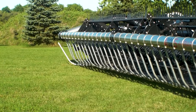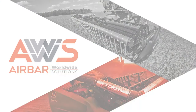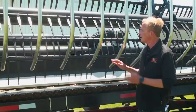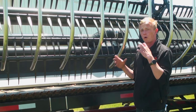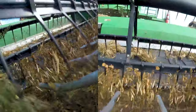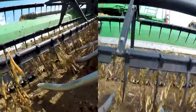AWS AirBar utilizes a single nozzle length design across the length of the head — either the 42-inch single bend nozzle or the longer 48-inch double bend nozzle. This ensures the greatest effectiveness and that there are no dead spots of air across the length of the knife. The incline of the canvas and more forward reel position of a draper head require a unique solution; the 48-inch double bend nozzles wrap the reel more efficiently, effectively moving crop up and away from the knife.